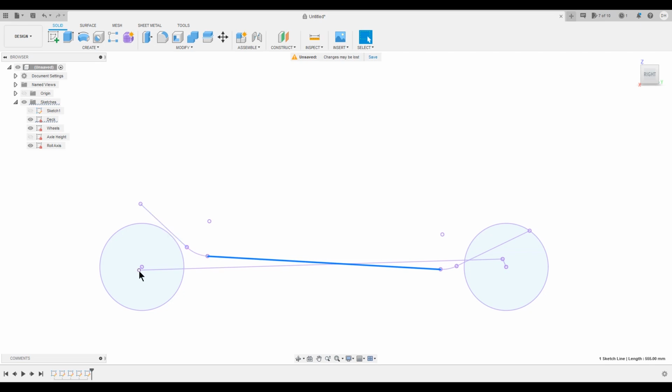But I'm imagining that having some of that top mount leverage might bring some of the liveliness back to the front. In addition, I've noticed through all the footage and riding on the hill that it seems to be more difficult on the mountain board to keep your weight forward on the front truck, and that's necessary in order to keep the whole setup stable. And so I feel like it might be worthwhile to pitch the whole deck upward a little bit to make it easier to keep your weight forward.